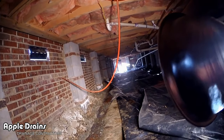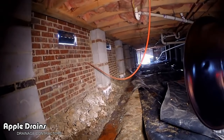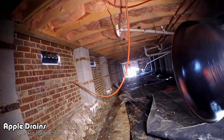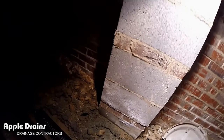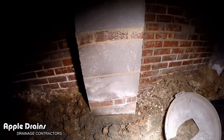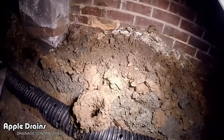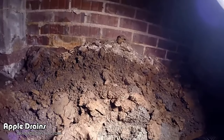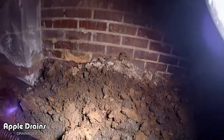They really did a bad job, to put it bluntly. You can see all the dirt mounded up on the side - that should have been graded out. Water just extends all the way through here, and moisture is getting up into the house. They run the risk of termites, which are pretty bad. You can see they've put perforated pipe with holes pointing up, which does absolutely nothing, and there's no gravel. And this little mound right here is a crayfish mound - that's how wet this is. They burrowed a hole down here; it's so wet all the way through.